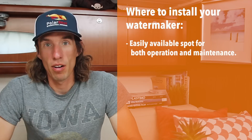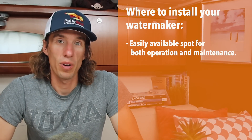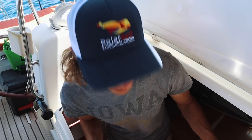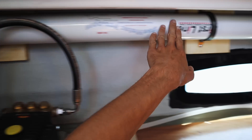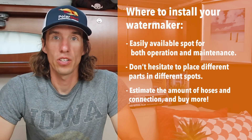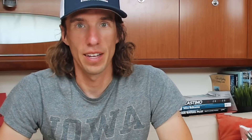Before you start buying parts, it's a good idea to map out where all the parts might go. First, place your water maker in an area that's easily accessible — you're going to be running it a lot and you want access to all the filters and valves. Second, remember that the DIY system is modular, so you can place parts wherever you have space. On board PolarSea, I chose to put the water maker inside our garage and build most of it on a panel on the wall. Estimate the amount of connections and hoses you need and buy a few extra — those parts are generally cheap and it will save you a trip to the hardware store when something breaks. Mapping out your system ahead of time gives you an idea of how the installation will go, but this is a boat project and things will sneak up from time to time.